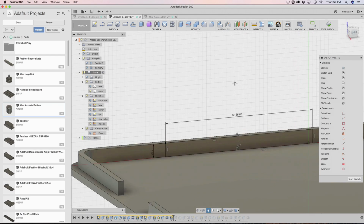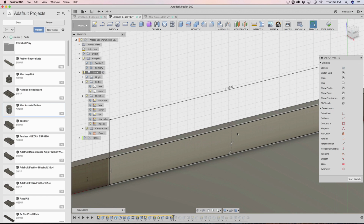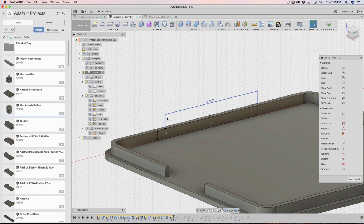That was a little bit weird. Now I'm into it, and you can see how I built it. It's a lot like the nub. It's very much similar to the nub. It has the exact same thing. Spacing multiplied by down divided by 2. But I added a little bit. You can add a little bit of extra offset if you want. So I put +2 because I want this indentation to be a little bit more open on the left and the right. So that's why I added 2. You don't have to do that depending on your printer or whatever. But that's what I found worked okay.